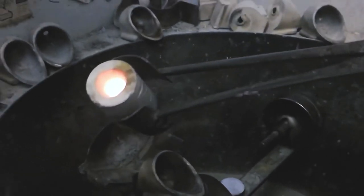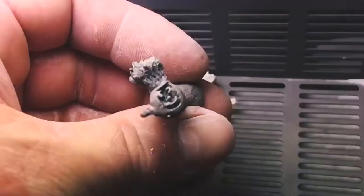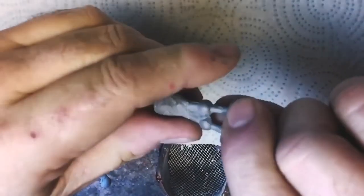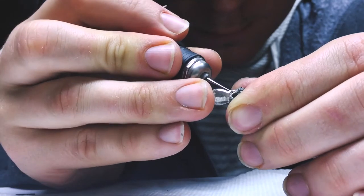After the metal cools, we hammer out the ring, put it in the sandblaster, and blast all the investment off. Then we have the cast metal design. Then we cut off the sprues, and we begin to finish the metal, smoothing it out and grinding off extra details.